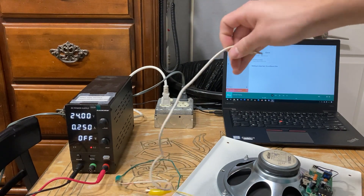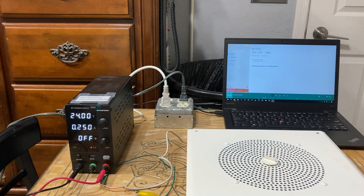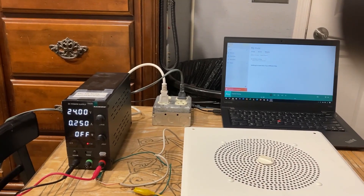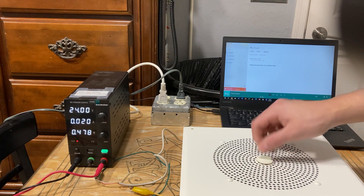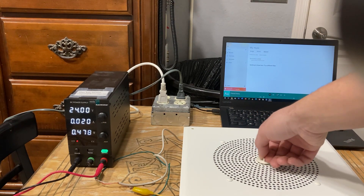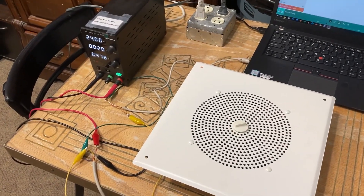For my audio source I'm using this laptop. I'm going to gently put it back on the table so you can hear it. I'll make sure my leads are not shorted — they're not. If you have this in a permanent install you're not going to do what I'm doing here. Now I'll fire on the bench power supply. I heard a pop and some ground loop noise. I'll click play on the computer — and you can see I can adjust the volume.